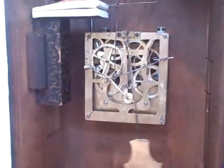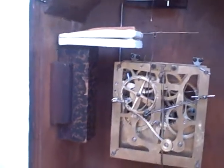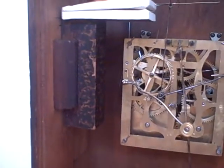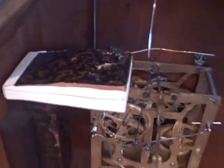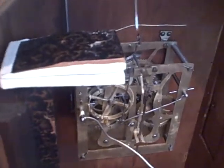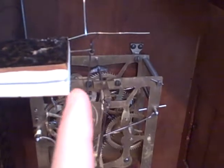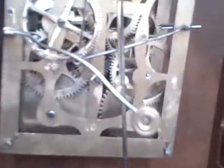The movement is a cast brass movement in the lyre form — a very interesting design. It has a very large bellows on the left-hand side of the movement, and it still has its original top. The clock was just restored and the original bellows was recovered in new skin. That bellows hangs a good distance over the movement, much farther than a cuckoo clock would, and is also substantially larger in diameter.